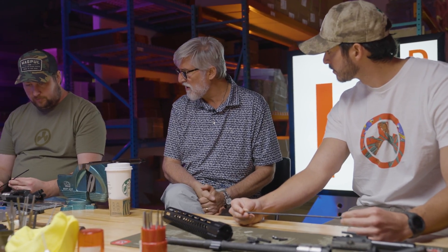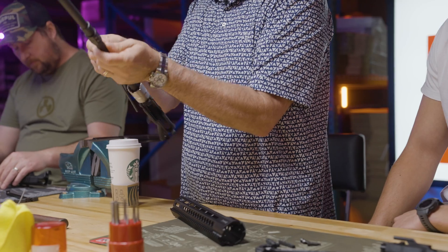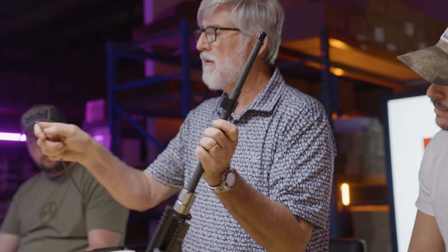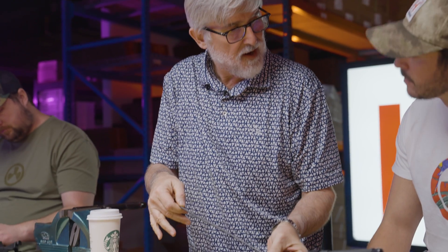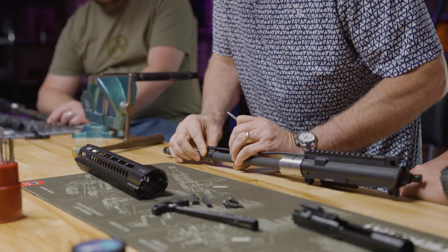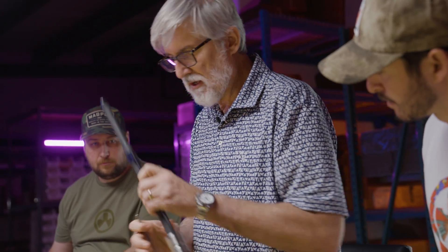The gas block has already been installed on the gun. I'm going to look at the gas tube — there's a hole that's going to correspond with the hole from the barrel in the gas block into this little hole, and it's going to send gas all the way down to operate the system. Drive it in, we've got a good equal distance on either side, it's flush, and that's it.